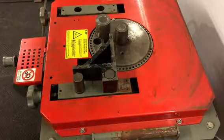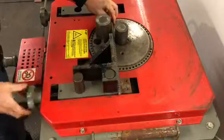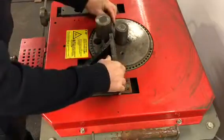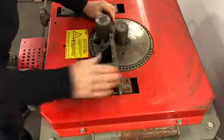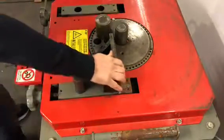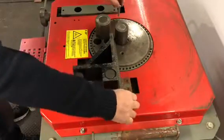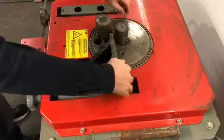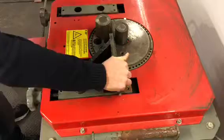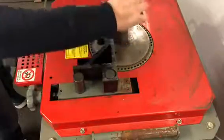When setting up to bend the bar, make sure the machine is at its home position, then drop your bar in and adjust the squaring arm so it's reasonably square when there's pressure on the bar — so deflection doesn't make the bar go out of square when you're bending. Select the angle to test it; you can under-bend it first so it's less than 90 degrees, just to see where the machine's going to bend to. As you can see, it's under-bent now.